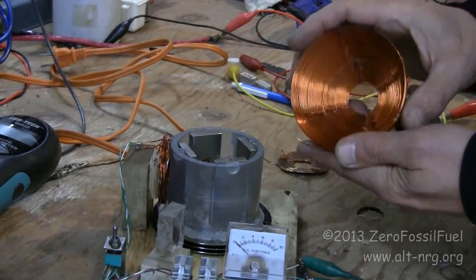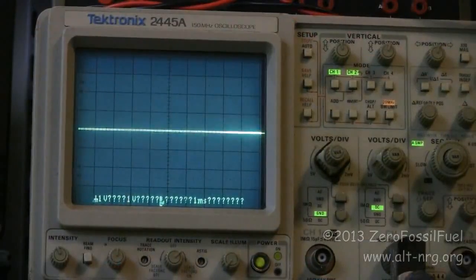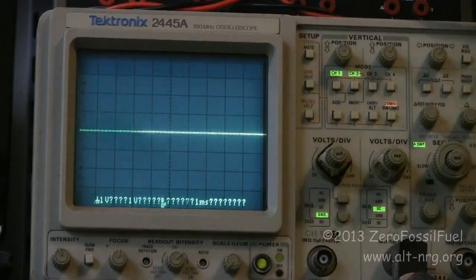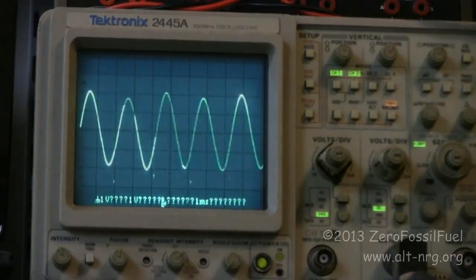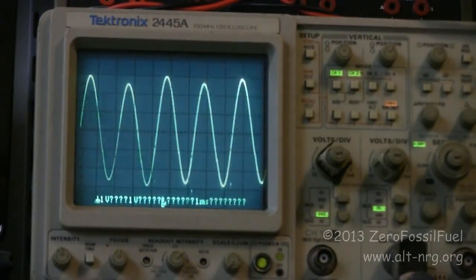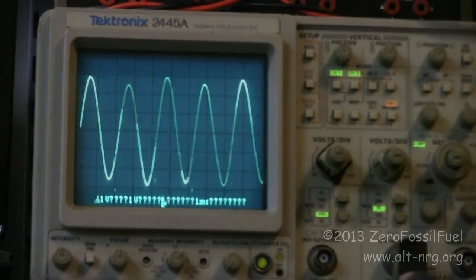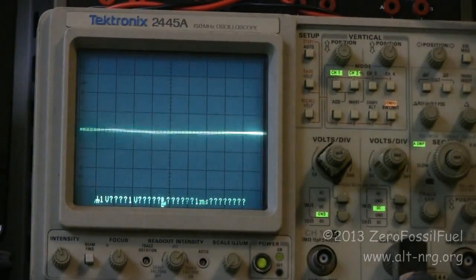I have to call the inside of this coil the quiet zone. For the record, here is the actual test with the large half-sphere coil. This is with the backside facing the rotating magnetic drum at 7,000 RPM — I get a maximum of about six volts peak to peak. This is one volt per division.